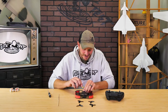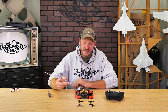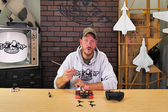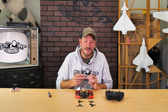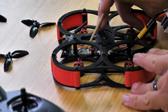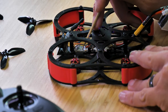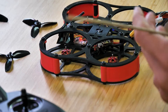The next thing we're going to do is plug in our Guardian V2. I'm going to use my barbecue skewer — any time that you're poking around any kind of control boards or anything that has current going through it, make sure that you use something that's wooden or non-conductive. Right on the top of the receiver here, you're going to see a little tiny button that we can press down. We're going to go ahead and press that down, and we should see a light light up. There we go — we have our solid red light.